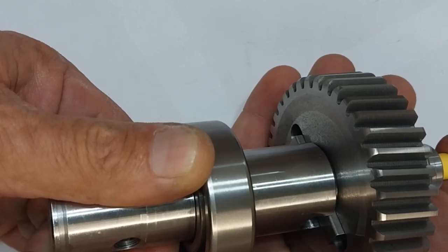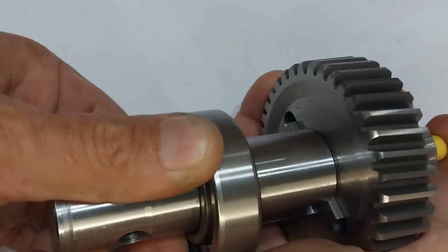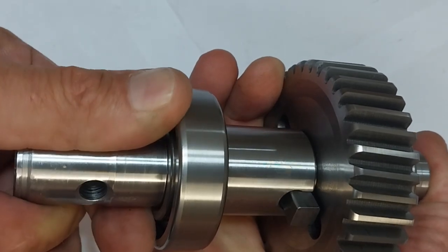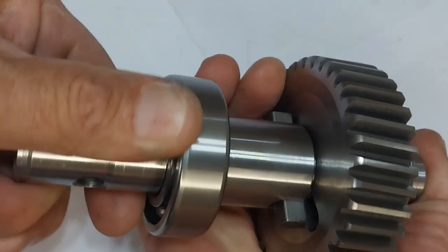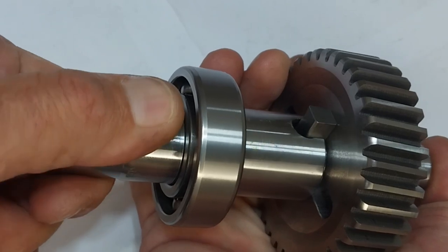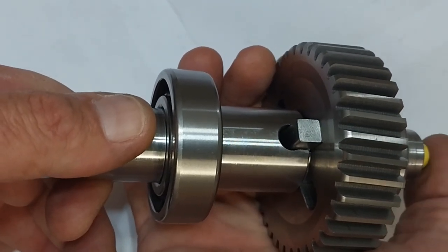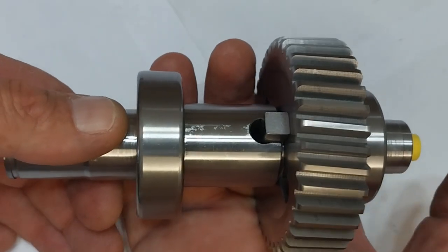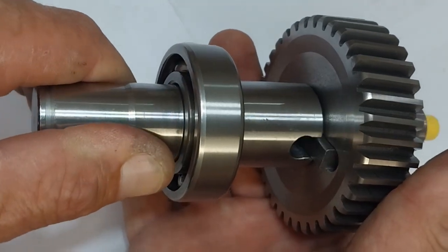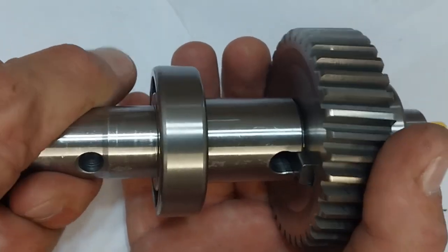Watch my finger with a yellow push as the screw is pressed into the manual position — the pin slots move out and it allows one to move the gate, as the gate motor is now in the manual position. Putting the gate motor back in gear is easy: just unscrew it and move the gate and it will lock into place, which means that everything is one unit again.